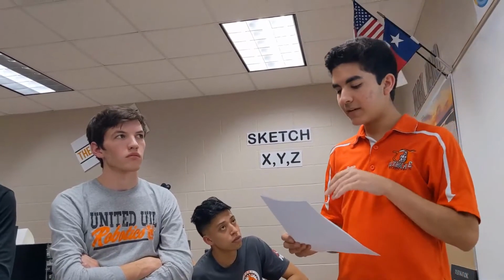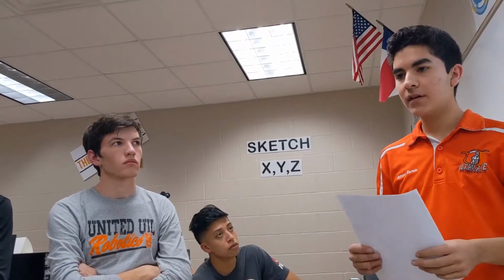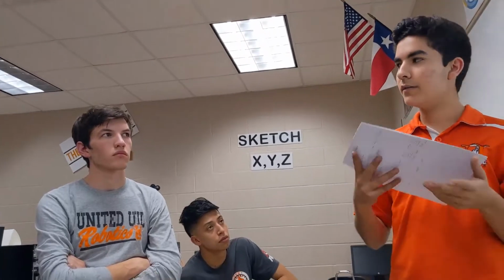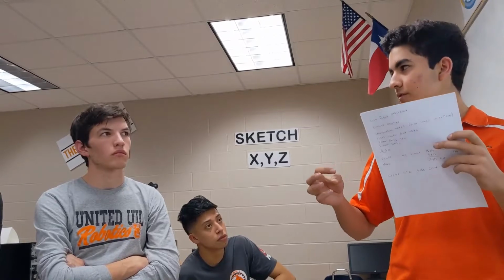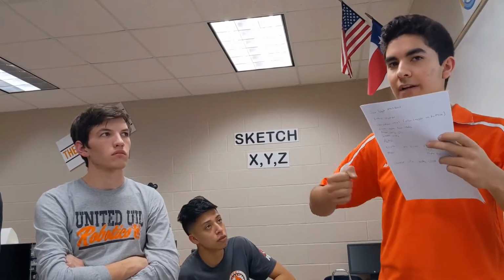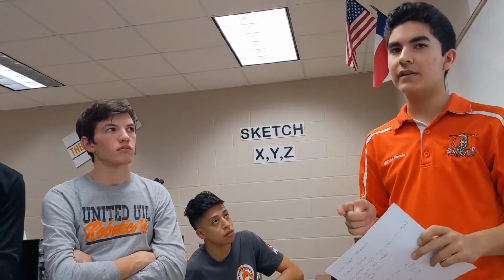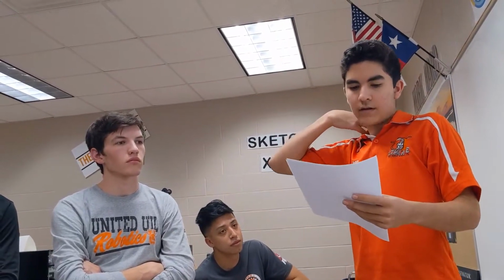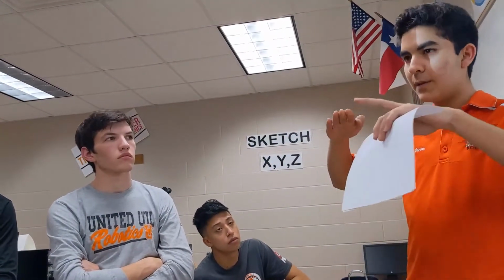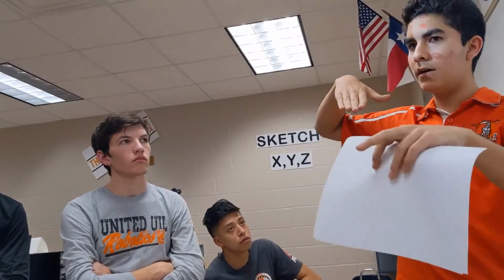And the way we would maximize getting the 23 points on the inner is by calibrating at the beginning of the competition. We have an adjustable 2-wheel shooter where it's a manual adjustment. So once you test it, you can set it down with like a wrench. That way it won't move, and you can guarantee that at that line in the center of the field, you'll always get the inner. And then if the linear intake is not able to reach as far low, you can always move it down to have it go in and out lower.